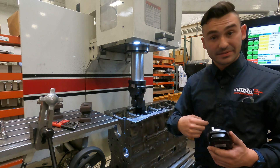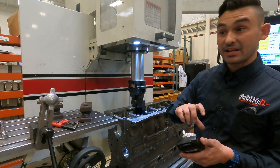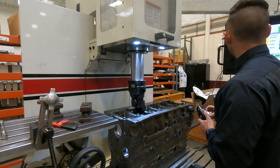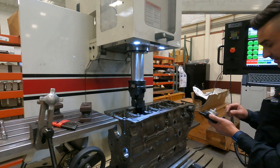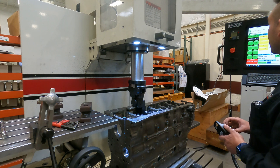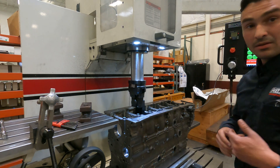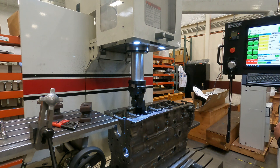On the tenths with the hand wheel, there will be some backlash because it's such a fine movement. So whatever you want to move, move the opposite direction first — maybe a thousandth or two thousandths of an inch — and then move back to where it needs to be. I've got about one thou out. I'll sweep it to the back just to double check that number — still showing about a thousandth. I'll switch to my tenths increments, go past, then come back. Split the difference at a half thou and sweep the block. About two to four tenths — we'll call that good.